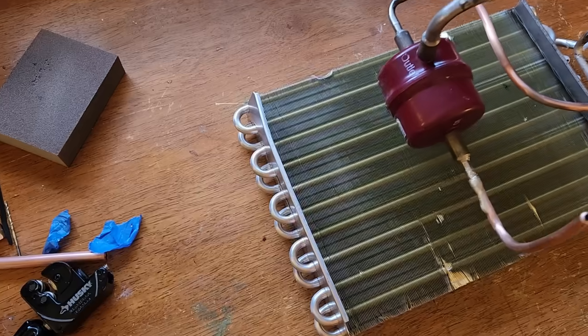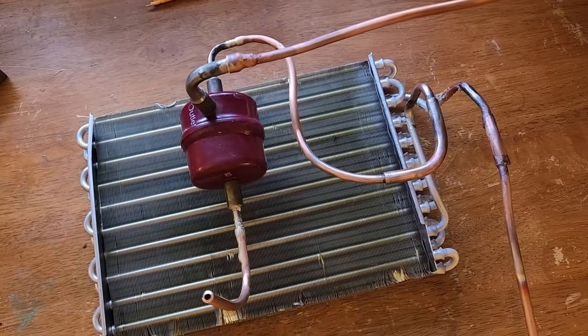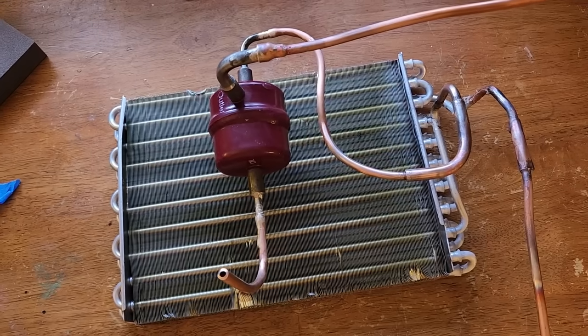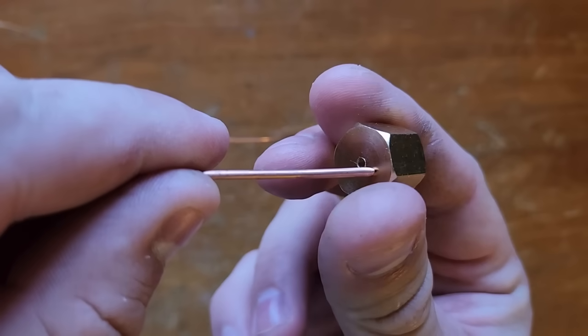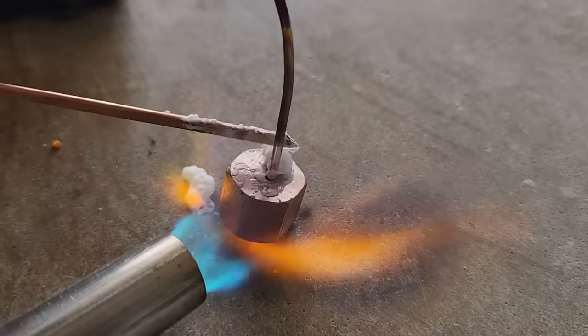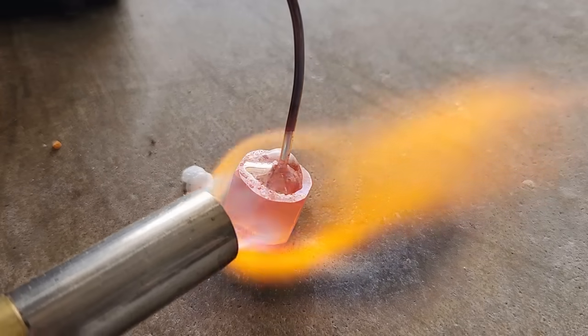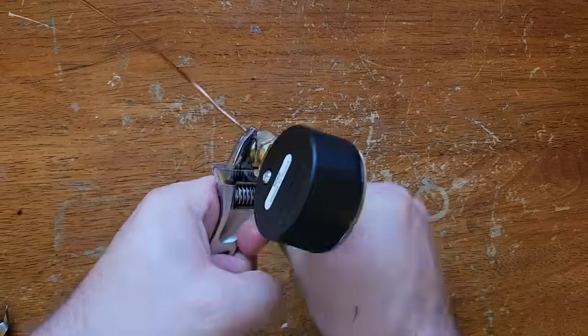After that, I brazed the separator to the outlet side of the aftercooler coil, which had previously been the evaporator coil for the window AC unit I took apart in my vapor compression video. To make the connections for pressure gauges, I brazed a 1mm inner diameter copper tube to a ¼ inch MPT cap with a hole drilled in it. Copper to brass doesn't require the silver solder, but it does require some flux to stick right.